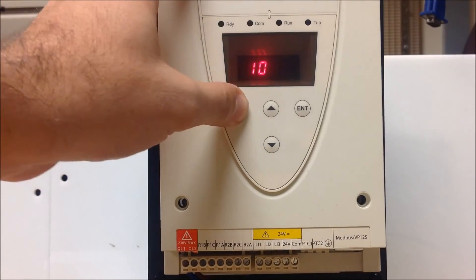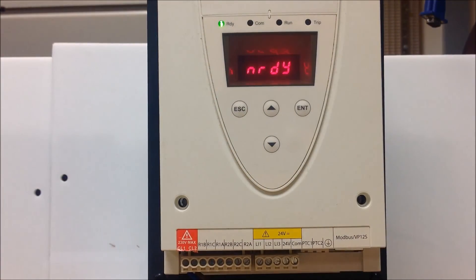The last thing to mention is that at any given point, if you see an NRDY in a 3-wire configuration setting, that just means that your LI1 is not made yet. It could also mean that you have no 3-phase power, but in most cases it just means that your LI1 is not getting any control power — and that means your stop is open.